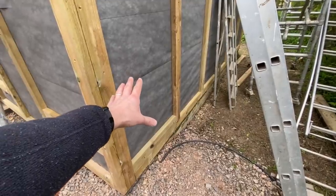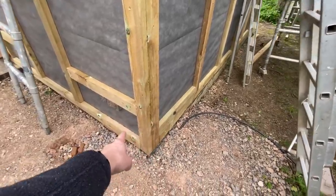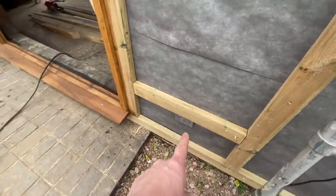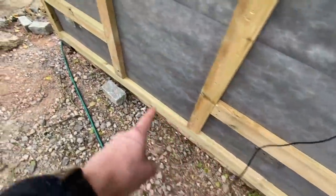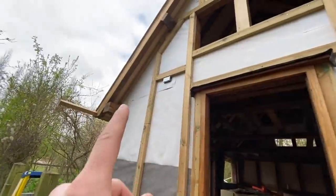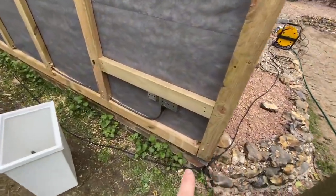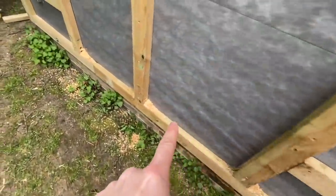So basically the DB's going on here and this is the main armored cable that's coming in, and then from there I'm going to come out in and out of these sockets, one radial along this side, so you've got one double socket, two double socket, along under this step here, third double socket, fourth double socket, fifth double socket, and then up to that one, and that will be the end of line. And then I'm doing the same, it's like mirror image on this side basically. Down, so that'll be the end of line, down along through the oak in the corner, in and out all the way along under the step, all the way around.